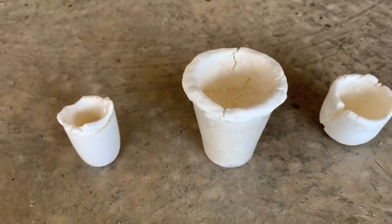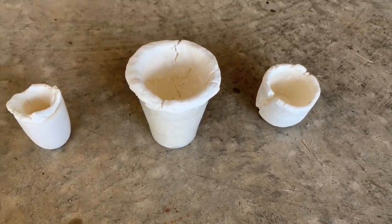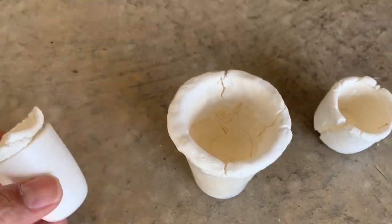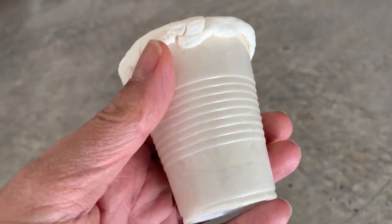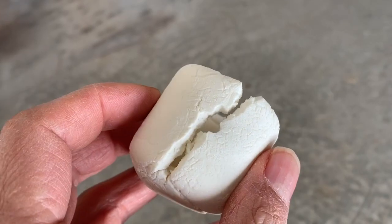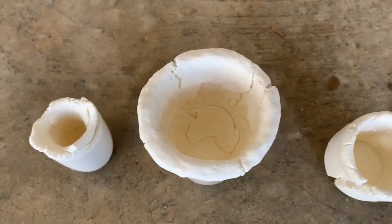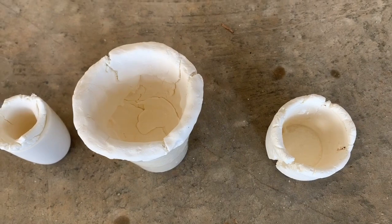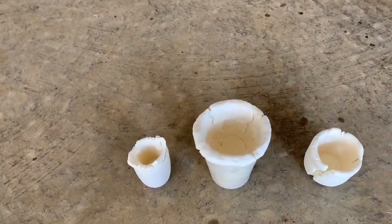My last video showed failure of a starlight crucible when I attempted to put it in an induction heater and melt iron in it. So I've made some new starlight crucibles here. This one is in an aluminum oxide crucible — I just pasted it on the inside. This one's on the inside of a plastic cup, just covered the inside with the starlight material. And this one doesn't have anything, it's just plain starlight — it's cracked up a little bit but should still work. At the suggestion of one of my viewers, I'm going to carbonize the inside of each of these by heating it up with a torch until the whole inside is covered in a thick layer of carbon foam, and then I'm going to test them in the induction heater.